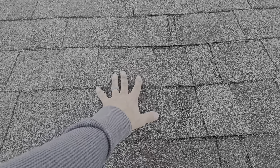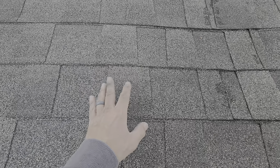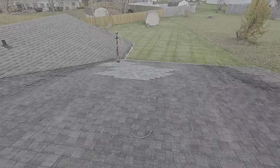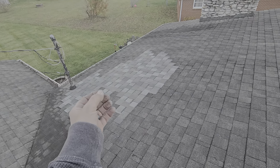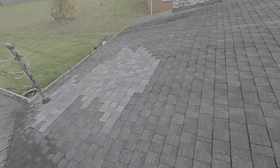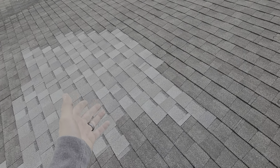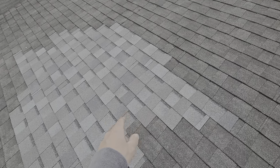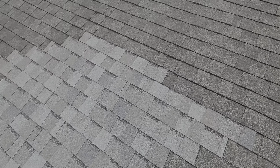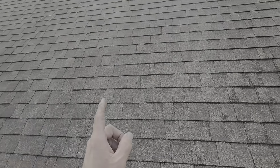Remember we talked about the color of the shingle? Driftwood and other manufacturers' colors that are very similar shade to this are very common and never going anywhere. Somebody has been here and done a repair back here. When you do a repair, it may or may not bring it back to pre-leak condition. But this is not even close — at least try to get something close to the shingle color. There are many brown shades like driftwood or teak that would have matched better.